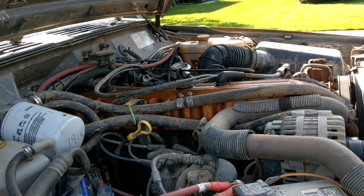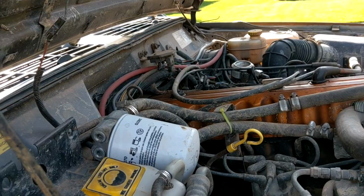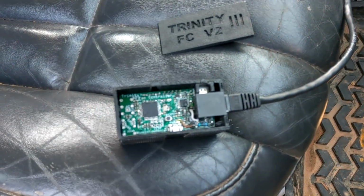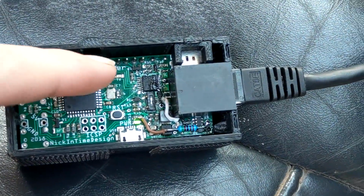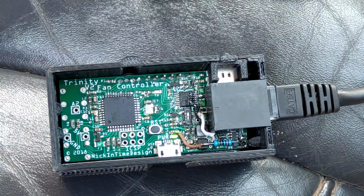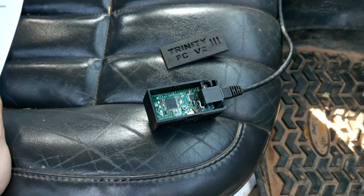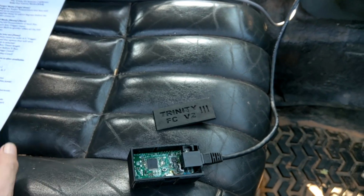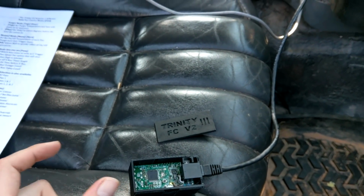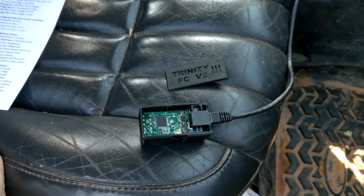There's a lot of complicated math behind the scenes, but it is an option. Again, we like options. Option the second that still needs to be coded in: our fan controller over here, the relay controller, supports PWM. What that means is we can pulse it. That's pulse width modulation. We can turn the pin on and off really fast. And the useful thing is, by changing the duty cycle of that pulse width, we can control the fan speed.